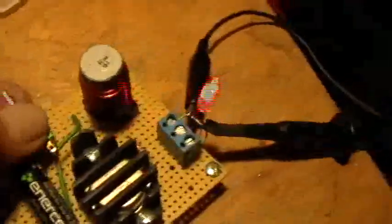I have the oscilloscope probe hooked directly across the output — the neon — and there's a rectifier diode there too. I'll turn it on. You can see the neon is glowing brilliantly, and here's the oscilloscope display. We're looking at a 10x attenuating probe, and the channel is on 50 volts per division.